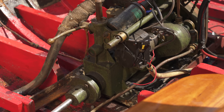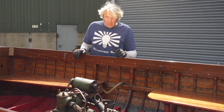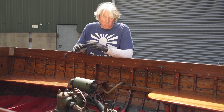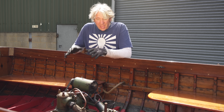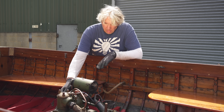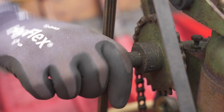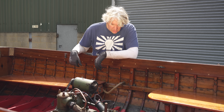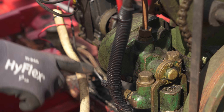There we go. The Stuart Turner P5M was one of a series of very reliable motors made by Stuart Turner down in Henley-on-Thames, which is also famous for the Rowing Regatta and Thames Traditional Boat Festival. This particular little beastie is a single-cylinder two-stroke motor developing four horsepower. There was a P5-5 which was a twin cylinder and obviously developed twice the horsepower. It's got a number of unique features you might not normally see on a modern engine — this shaft here means you can actually crank the engine over with a crank at either end, wherever you're sitting in the boat.